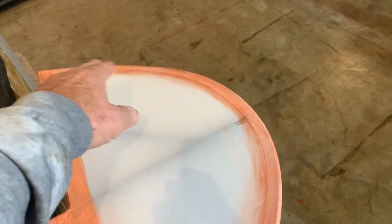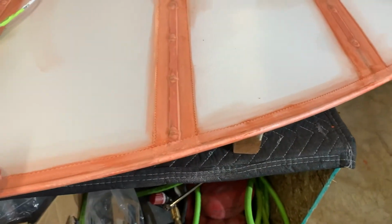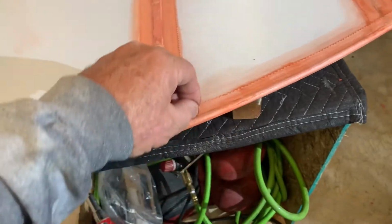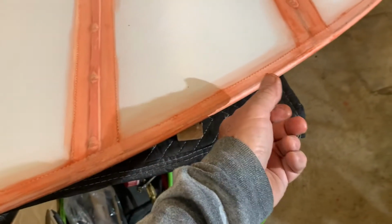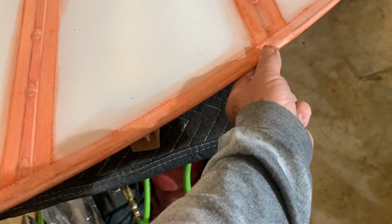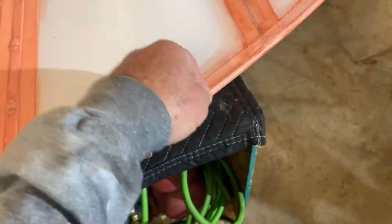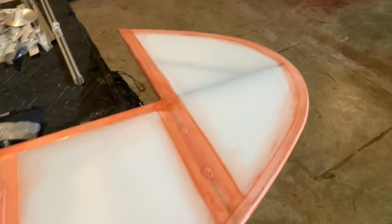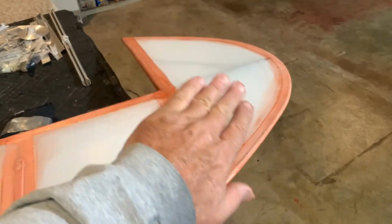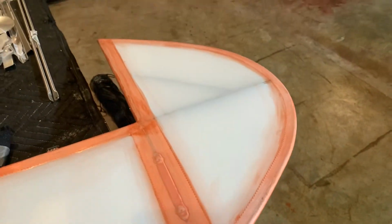And then I just leave the clamps in. I come back and put some poly brush in between the clamps. And pretty much by the time you've gotten from one end to the other end, kind of doing the edge and everywhere, then you can come back and I take that clamp off and move it just a few inches to where I've just poly brushed. Then I'll take my iron, fix that up real pretty where that clamp was, put a poly brush on it, and go to the next one and so forth. And by the time you've done that, you can take all the clamps off. And then you can turn it over to the other side and do the same thing. Iron it down nice and flat all the way around. And you won't have any clamps in your way then, just poly brush it in.